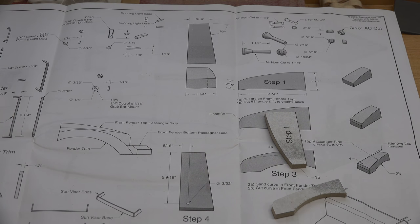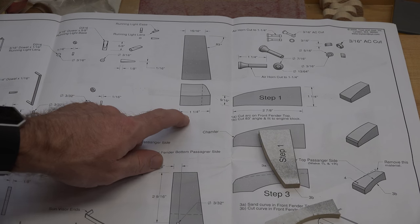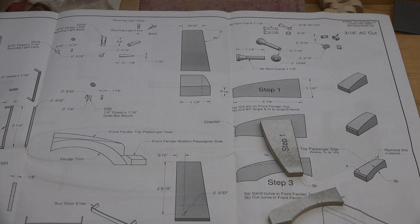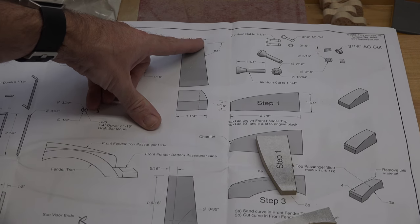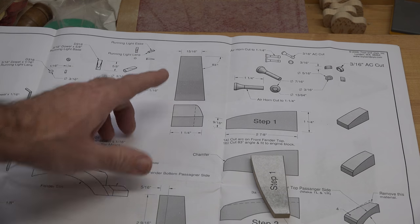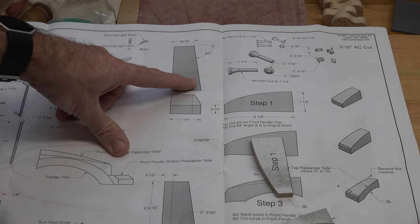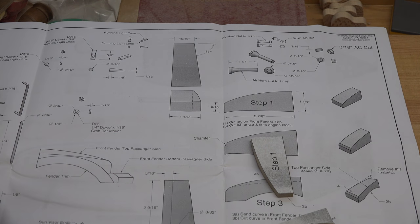You can take what I just said about cutting those pieces and scrap it. As I said, part of the fun of these projects is the problem solving, and that's what I've come across now. I had planned to cut stock to inch-and-a-quarter by inch-and-a-quarter by two-and-seven-eighths inches, but when I thought through the process and realized I have to cut a seven-degree angle so the fenders mesh properly with the engine block, I realized I was putting myself in a dangerous position trying to cut that angle on the table saw with such a small piece. It didn't feel good — and as I've said before, if it doesn't feel good, don't do it.